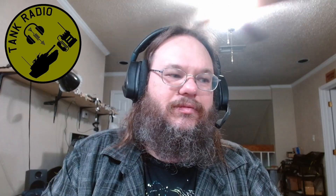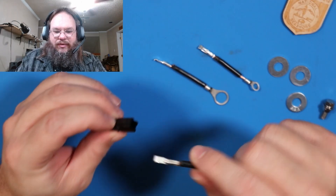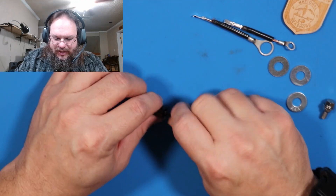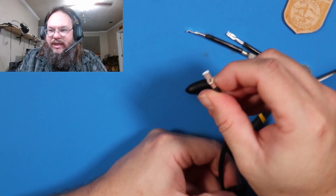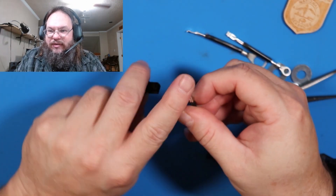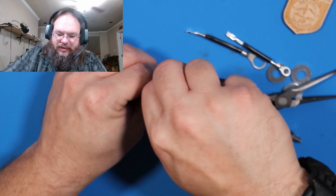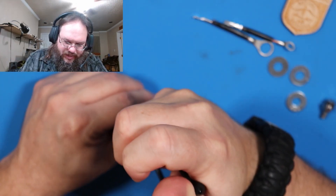We got power pole, power pole, power pole, power pole. I am just going to put black into all of these because it's technically all ground and I feel like that would be the right thing to do. It's going to bother me later when I run out of all the black ones. How I remember what end goes in which direction: I look for the flat top, turn the loop around to curve down, flat top goes into flat top, and just push it in. I find it easier to use some needle nose pliers to help push that down.